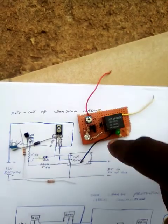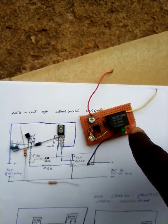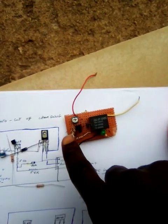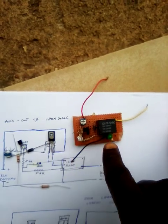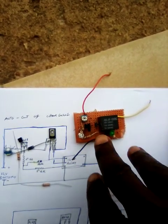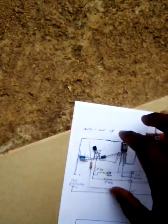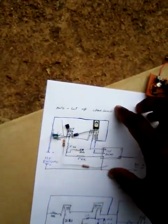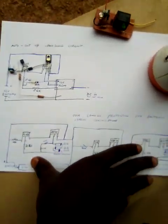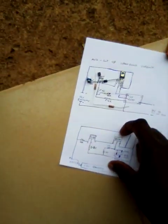I will take it to a darker place when I test it. You'll see this LED will be on and this one will also be on to show that it is fully charged. Once it stops charging, this other one will come on as well. That is the advantage of having two LED bulbs here. This is the auto cut-off protection — when it reaches 12V, or depending on how we adjust the variable resistor, it cuts off. This is the voltage regulation mode.